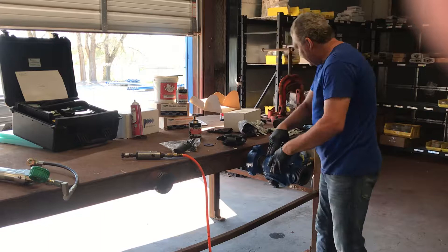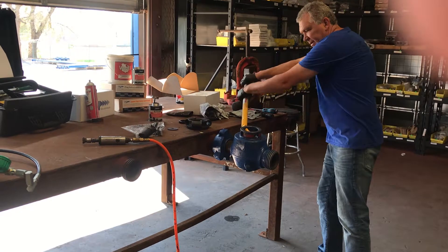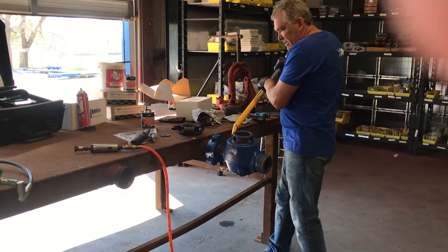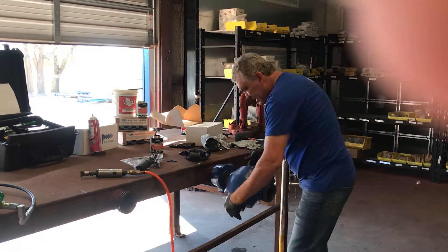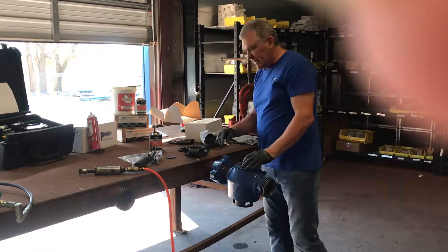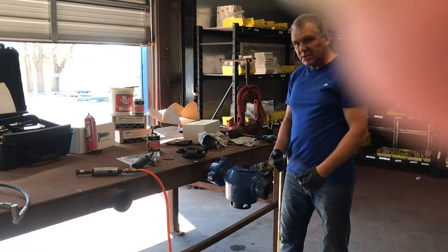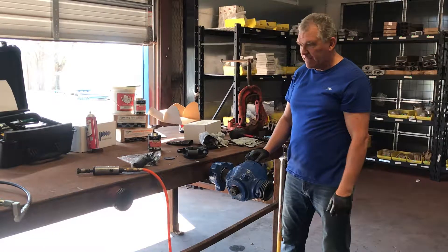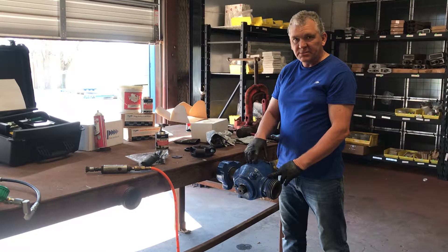I usually wait to make sure things are perfect. Then check one more time after tapping the plug to see if there's anything left — make sure everything is snugged up. I call this 'setting the plug,' which ensures your plug is seated properly. It's a little extra step, but it works. Tap it one more time, then reinstall your handle. Then grease it to 3,000 pounds, cycle it once, grease it again to 3,000 pounds, flip it over, and check the nut again — most likely it's going to move a little bit more. This is Shannon with TSI. Check out our next video on disassembling. Thank you.